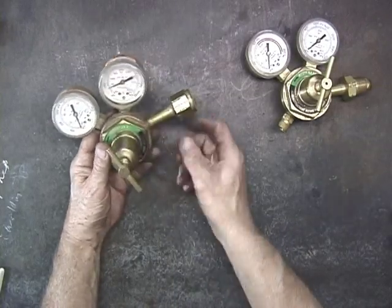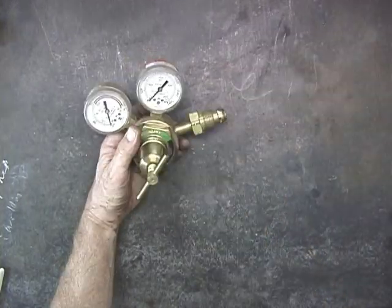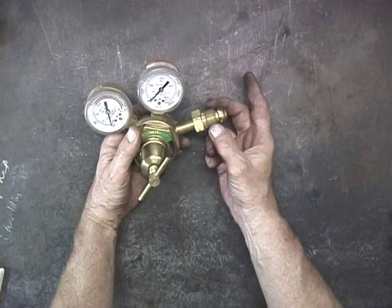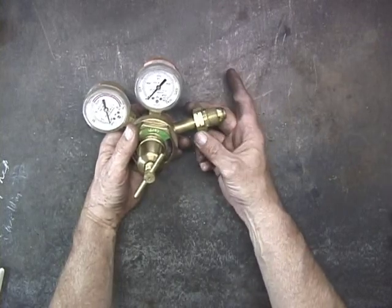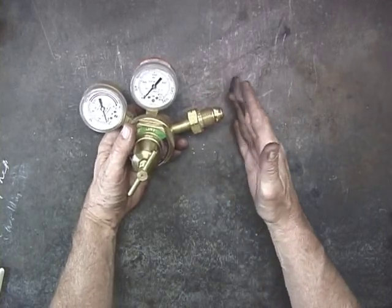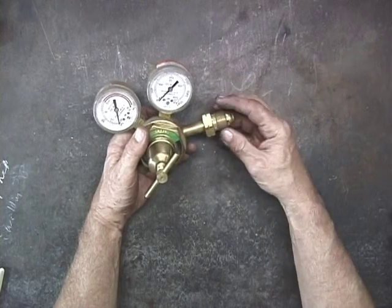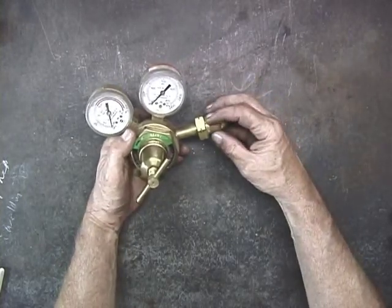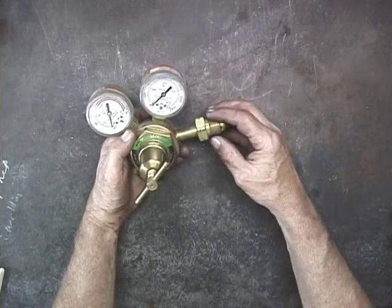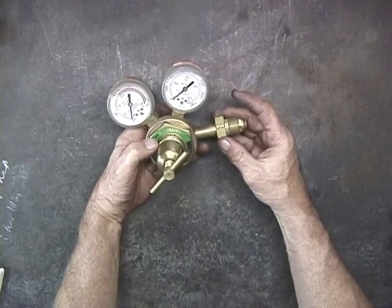Attaching the oxygen regulator to the oxygen tank is very straightforward — slip it on, tighten it down. The acetylene regulator is a little bit different. You'll see notches right on this nut right here — that indicates that it's left-handed threads. So when you put this into your acetylene tank, you go counter-clockwise to tighten it. Also, different welding companies have different types of acetylene tanks, so you need to make sure that this is going to fit into their tank. If it doesn't fit, there are adapters — the welding company will have an adapter. So if I was going to get oxygen acetylene for the first time, I would take my acetylene regulator to make sure that it fit on their acetylene tanks.